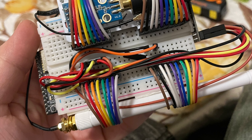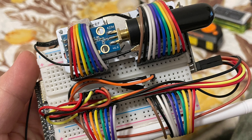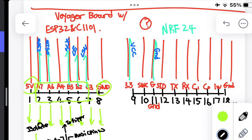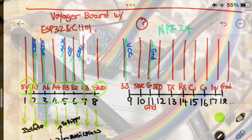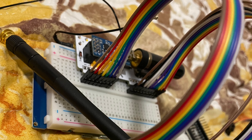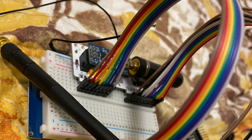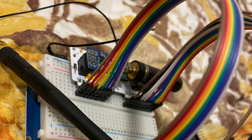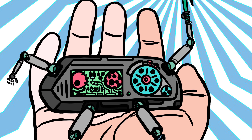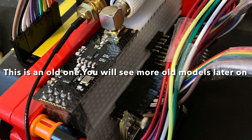You may have noticed that I am using an existing Voyager board here. It handles the connection of the ESP chip and the CC1101/NRF24 module. Normally, you could only use two at the same time — either ESP plus CC1101, or ESP plus the NRF. But with a little bit of help from some nice genies, I was able to snake the NRF module right into the same loop.